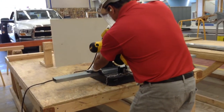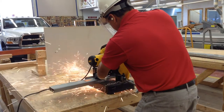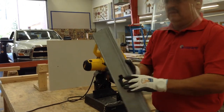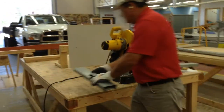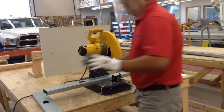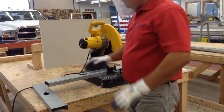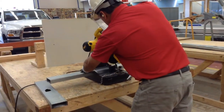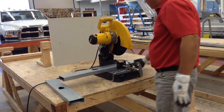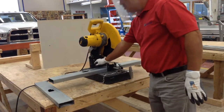I cut it — see what I told you, that it is hot? Did you guys see that, how the spark was in it? We don't want to touch that — that's why I grab the center of the stud. There are two ways to do this: I did it freehand, but you can also use the vise. If you guys are not experienced like me, I recommend using the vise. Same thing — before you adjust it, line it up, then secure it so it's not moving on you. We're ready.